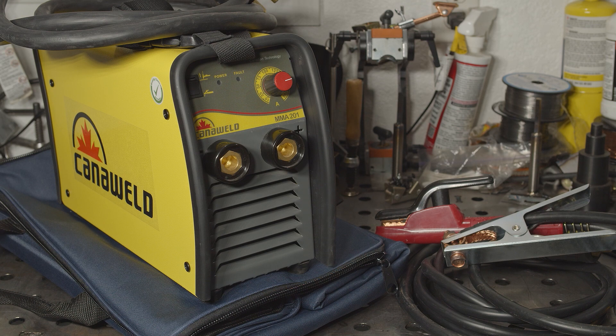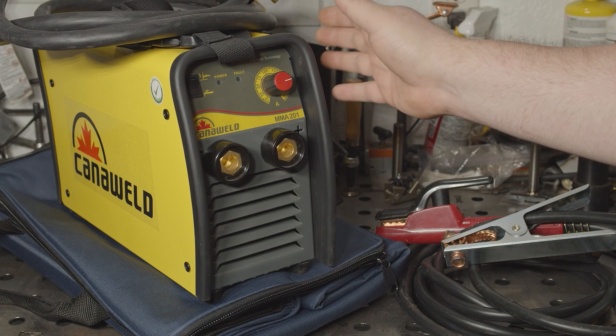It has a maximum output of 200 amps, with a 100% duty cycle at 150 amps in stick mode, and a 100% duty cycle at 180 amps in TIG mode. They claim that this rating was at 104 degrees Fahrenheit ambient temp. It also claims to have hot start, arc force, and electrode anti-stick functions, but they are all controlled automatically — none of them are manually adjustable. This machine operates at 208 to 240 volt input. It is not a dual voltage machine; it cannot run on a 120 volt circuit. So it's a pretty simple machine, but let's pull the case off and have a quick look inside.